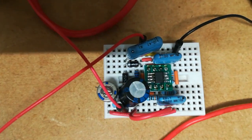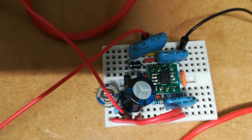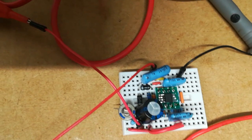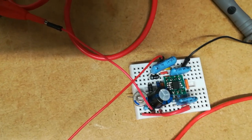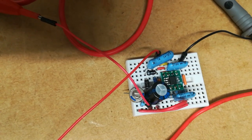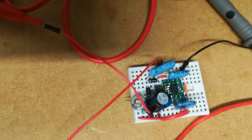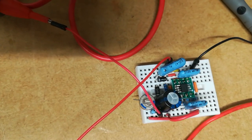Unfortunately, the high voltage IC is only available in a surface mount device, so I've had to solder it to a little adapter board there, as you can see. But that's basically the tiny circuit, a very simple voltage doubler, and then we use a potential divider to feed our BCM fooler. So we're getting certainly closer to actually trying to test it in the car.